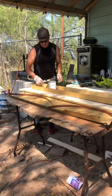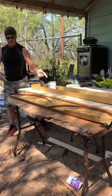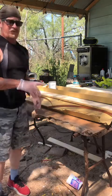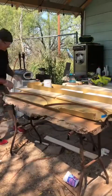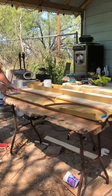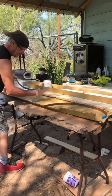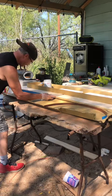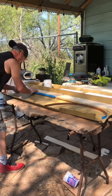And I can use this brush for a day because it kind of melts back when it dries up on here, but it'll melt it when you start using glue again. So now we wait 15 minutes or so, and then we'll do the glue on. Okay, dry to the touch, got a little bit of tack to it, but ready to adhere. So you want it to stick over on all edges so your router can do the finish work. So let's fold it up like that. Make sure especially that it sticks up on the top.